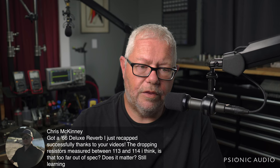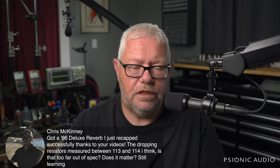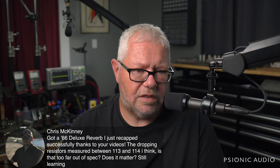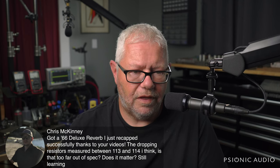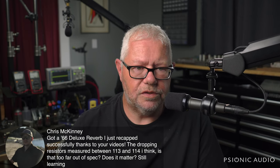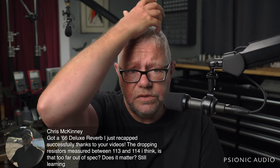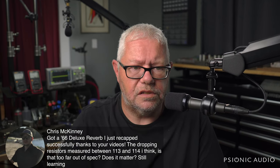Hey, Chris McKinney. Glad the recap went well for you. Dropping resistors measured between 113 and 114. You probably mean the plate resistors? As in 100K measures 113, 114K, that's 13% or less above. That's still within spec. Unless you hear noise or an odd behavior, that resistor is fine. If you mean a plate resistor, there are no dropping resistors that would be between 113 and 114. The dropping resistors in a Deluxe Reverb would be a 1K and a 10K for a '66.